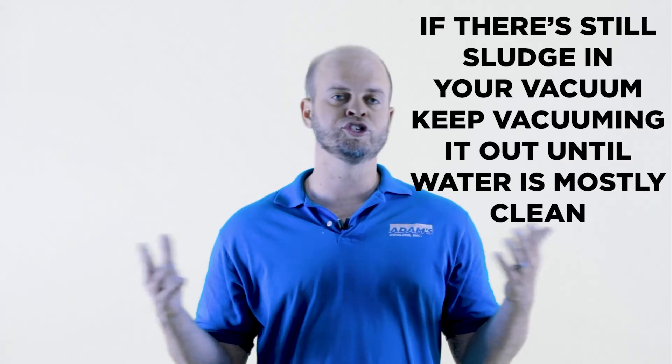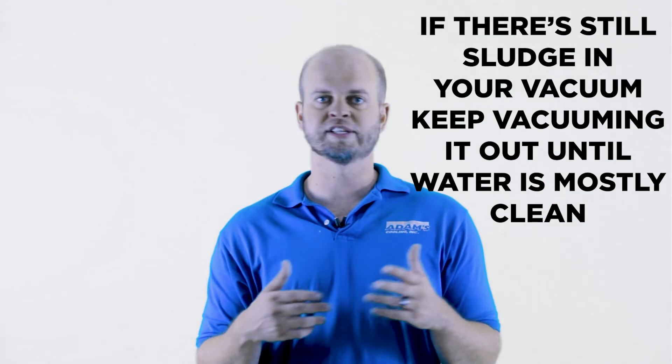I recommend doing that at least once a year. If you don't already have an AC guy coming out — which you should, at least once a year, just like you get your oil change — you should have your unit looked after at least once a year. But if you haven't, or if your line is still getting blocked up, just get a $30 vacuum cleaner at Lowe's or Home Depot, put it on the drain line and turn it on for about two minutes and just let it run. Shut it off, look inside, and you're probably going to find a bunch of gunk in there. Do that every three to six months if it's really bad, but usually every six months to a year and you're going to be fine.